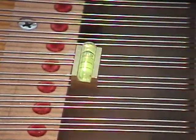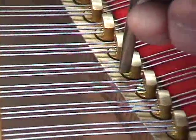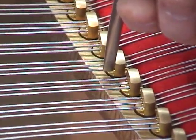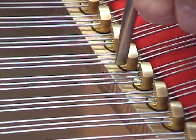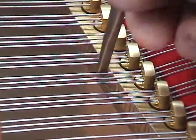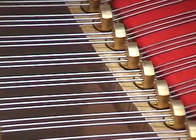I'm going to have to really lift this left string to get the bubble centered. The idea is you get the two outside strings to center the bubble and you bring the center string up to meet them. So I'm going to start by lifting the left string, which I just did, and I got the bubble centered.